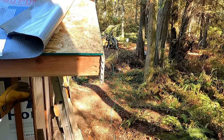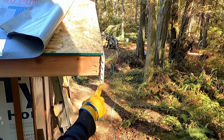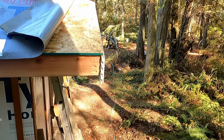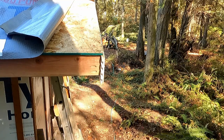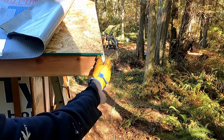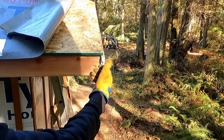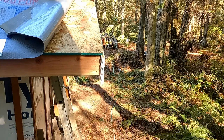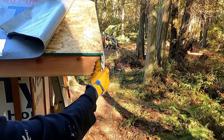I'm using this shed to experiment with a number of ideas, harebrained schemes, building techniques that pop into my head to see how they go. One of those is this plastic fascia. This is a PVC product and it's rot-proof because it's plastic. Fascia gets a lot of weather and I don't like to muck around with rotting wood and having to replace it. The problem is that water can still get behind it at the seams and at the holes, anywhere you have a screw through it or anywhere two pieces come together, because these do get wet. The roof barely covers them and gutters leak. So I want a fascia that's bomb-proof.